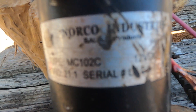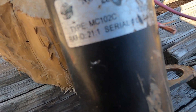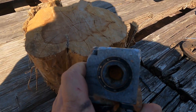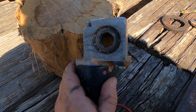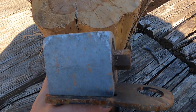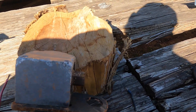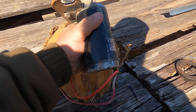I'm going to give you guys a close-up. It's a 12 volt — Norco, 21 to 1 ratio — so that ought to be a pretty stout little motor, type MC-102C. The way this motor is rigged, it's got a female hole here that is octagon — hexagon-shaped — and then it's got a male side over here. This hooks to the jack, and if the motor ever went bad, you have a handle that hooks up here and you can still crank your jack up and down. The motor's good — it works just fine. I've hooked it up and checked it all out.